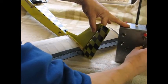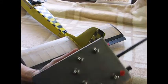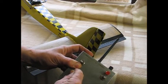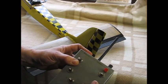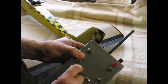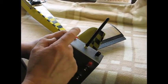A quick flick of low throttle takes us out of that. Now on the Tiny6 — a six-channel REEDS set — you just have rudder, elevator, throttle, so you wouldn't have a trim toggle. What we did on the Tiny6 is we had a button whereby you press the button and then do whatever trim function you want. So that's up elevator trim, and rudder trim — hold the button. So we've got the facility of either a proper REEDS toggle switch for trim, or you can use a Tiny6-style button for trim. Because this is a prototype I've got both on there, but normally you'd have one or the other.